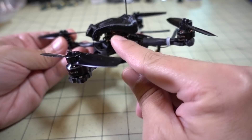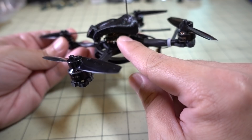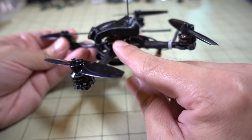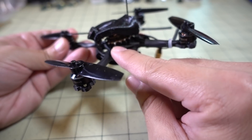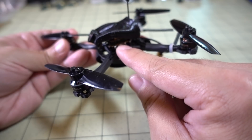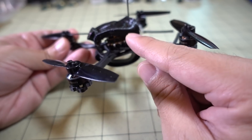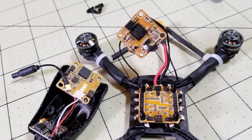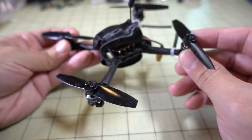The second board is your flight controller plus your receiver. It does come with a FrSky SPI receiver built into the flight controller board. The third board, the very top board, is the video transmitter which also has the Betaflight OSD. The flight controller is an F4. The video transmitter does 25 and 200 mW power, switchable, and it has Smart Audio — so it is pretty feature-packed.